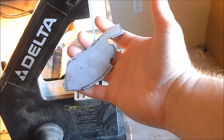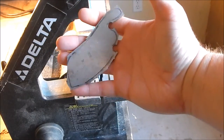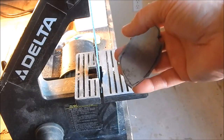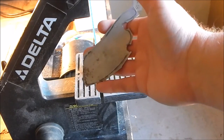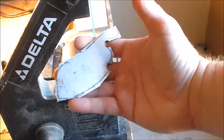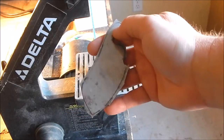Alright, so I got as much cut off of the blade with the hacksaw as I could. There's the really rough profile, and I'm going to go ahead and start grinding it. I've got a little 1x30 with a brand new 40 grit belt on there, and we'll be reducing belts and grains. We'll go down to 320 grit. But yeah, this is it cut out. There's the two 5/16 holes, and we're going to start profiling it.